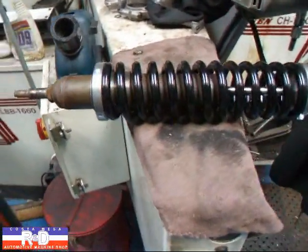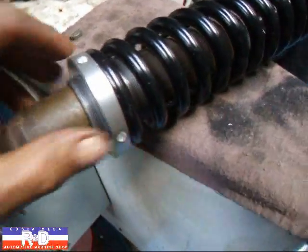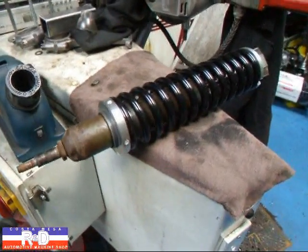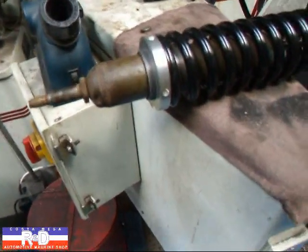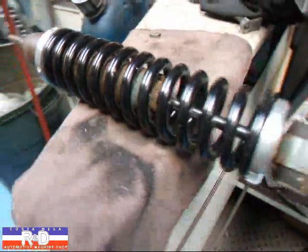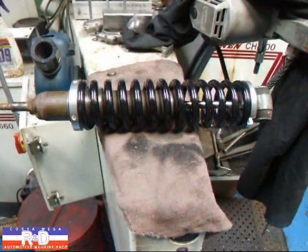Well, we're just about done. We've got the shock assembled, and I don't have this piece down here welded yet, but that'll come soon. I did drill some holes in here so we can actually adjust these things on the car to make it a little easier. All I have to do is figure out the right height and get those adjuster barrels welded into place, and we're going to have some coilover shocks on the Fiat. Yippee! Have questions about making coilovers for your car? Give me a call here at Costa Mesa R&D. We'll see you soon.